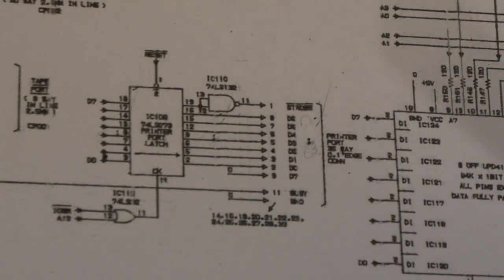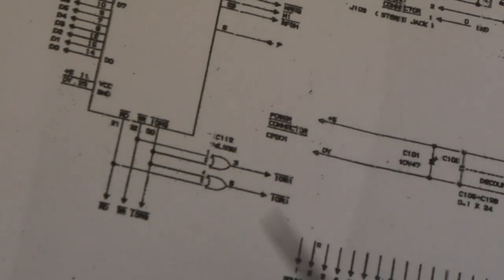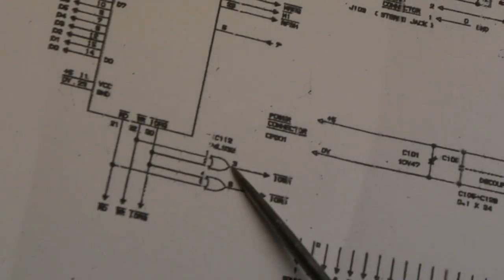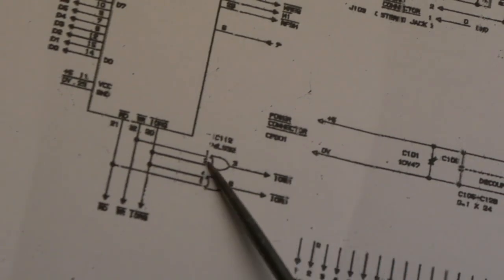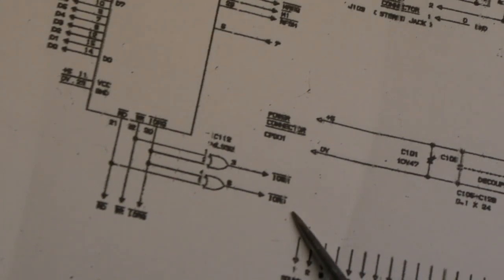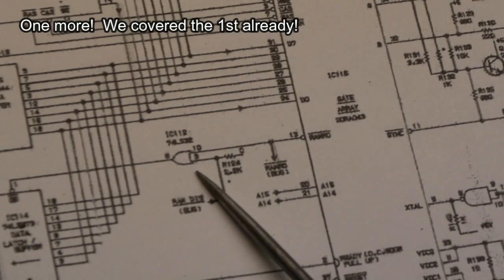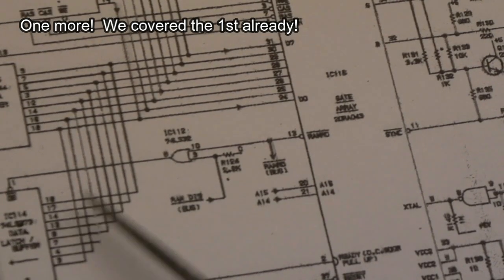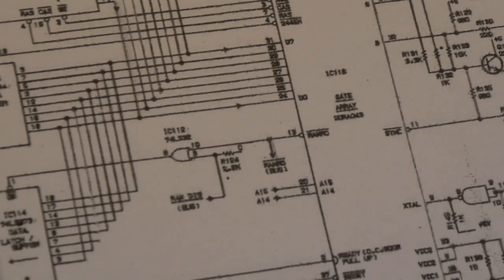As soon as we swapped that, it was problem solved. But that chip had 4 different gates around it. The 74HC32 or LS32 has 4 different OR gates on it, and there's 2 of them here you can see that generate the IOR and IOW signals, I think, and there's obviously 2 more gates perhaps used elsewhere. We've got one of them going to another latch, a data buffer. So it could have been any of those really causing the issue in that single chip.